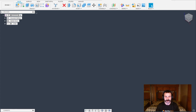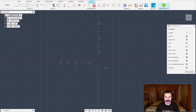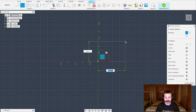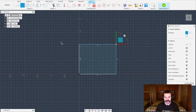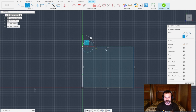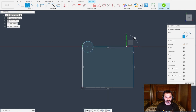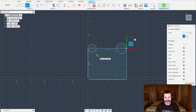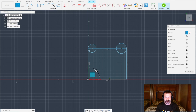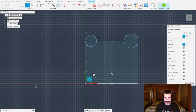We're going to start a brand new file, create our sketch, and pick our plane. I usually don't concern myself too much with what plane I'm drawing on because I'm always going to come back and adjust it after the fact. So we know our Mighty Byte is roughly three quarters by three quarters. I like to treat Fusion a little bit more like modeling clay — not adding dimensions until after the fact. Creating my circles tangent to my edges, and one final thing is to throw a centerline on here so we can set up our tap drill hole and tap drill size.